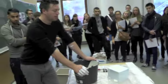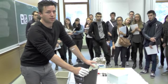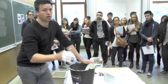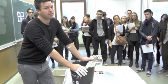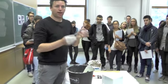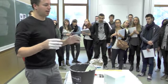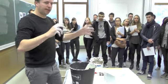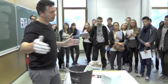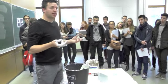We also pour sometimes into just a fabric mold. You have to pour in very small bits because it's very wet and needs a strong fabric. You can use leather because it has texture, or rubber — it also has texture. You can use even just foil that you crumble together. You can use everything, but you have to experiment. Then you know what's possible. If you're in a room with lots of different things, just use everything and try. Don't try to make the first model the right model — try three, four, five models and experiment with materials to see what's interesting.